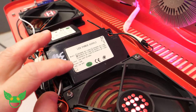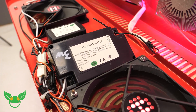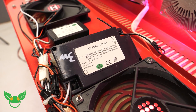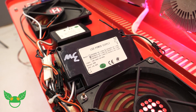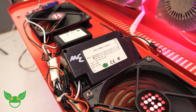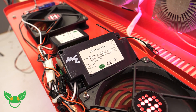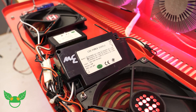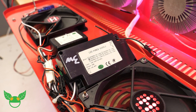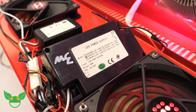The LED drivers take our wall power — either 120 volt US power or international — and convert that AC current to DC current to power the LEDs. This one conveniently has a label with an input range of 100 to 240 volts — that's the AC side. Many people give me this AC data, but I don't need that. What you need is the DC side: DC voltage and DC amperage or current, in amps or milliamps. Your options are probably going to be fairly limited because most of these LED drivers are somewhere in the high-voltage, low-current range — that means 80 to 160 volts DC out, but at only 500 milliamps, or half of 1 amp DC. Some go as high as 600, 650, 700 — the highest I've ever seen is 900 milliamps. Rarely will you have one that goes over 1 amp.